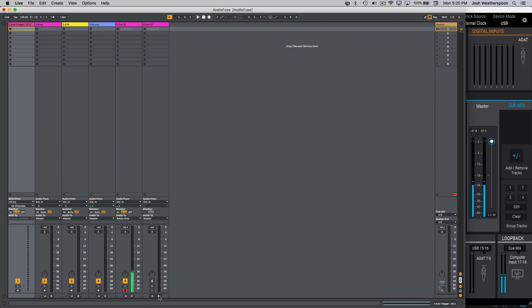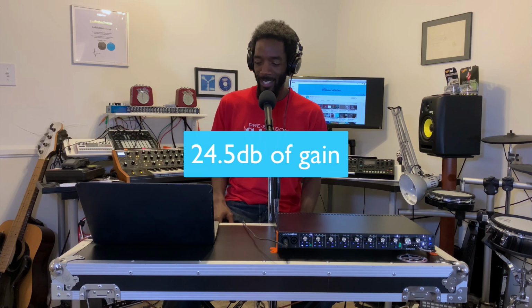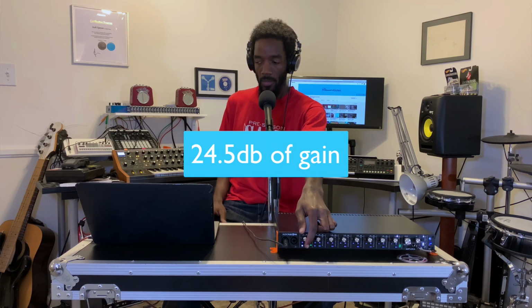And we get up to -35.5, which is 29.5 dB in gain, and it sounds pretty good. If I silence this, we can also hear there's not a ton of gain or noise. Actually, yeah, just noise kind of coming from the preamps, which is really sweet. So you can see it's a lot of gain to be added.